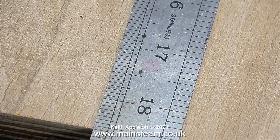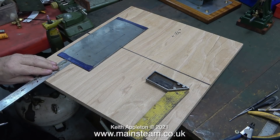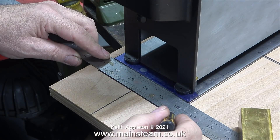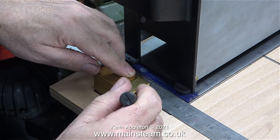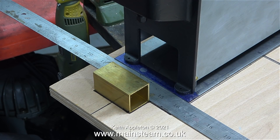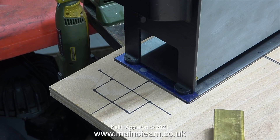I do like to keep my Patreon supporters happy. In this video I'm not going to show the planking operation - you've already seen that in a previous video. I've changed the dimensions slightly: this board is 17 inches from front to back and 18 and a half inches from left to right. I've drawn a line down the middle at the center point and lined up the steel plate, which is the boiler mounting, exactly in the middle. I need to cut a square hole for the sump. When finished, a grating will be fitted over the top, and the condenser, water gauge blowdown valve, and waste collector will all drain into it. I bought this piece of square-section brass from Black Gates Engineering and cut it to the required length.